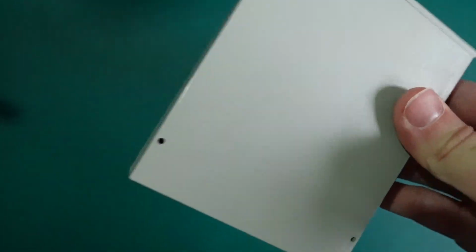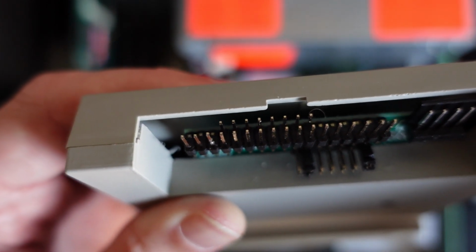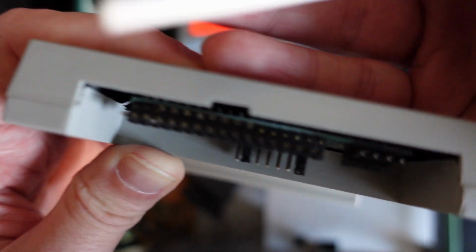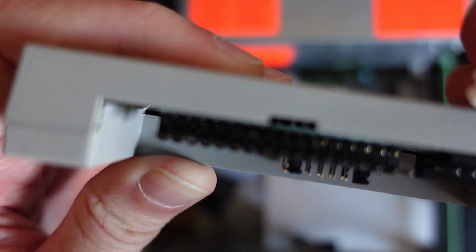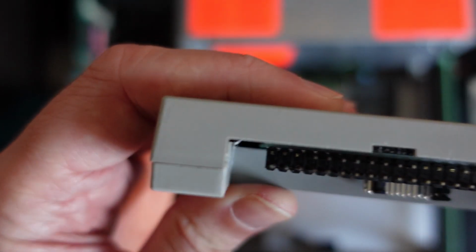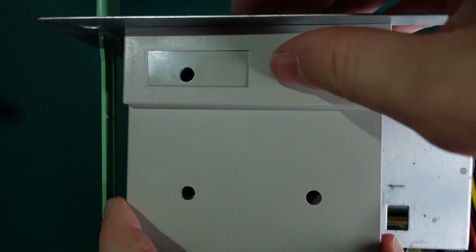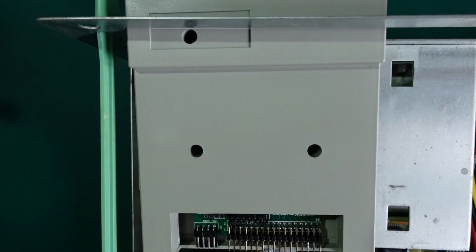As a floppy disk drive, due to the failure of the original drive, I will use the GOTEK emulator, a favorite among enthusiasts of vintage equipment. I modified the drive connector by removing the pins to which the power is connected in Tandy 1000 computers. Detailed information on this subject can be found in the Adrian's Digital Basement video about Tandy 1000HX. The link can be found in the description. GOTEK's casing slightly collides with the front panel of the computer. The solution will be to design an appropriate case for the drive and print it in 3D.